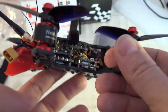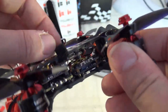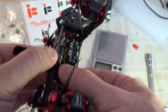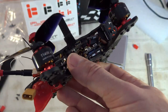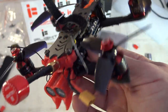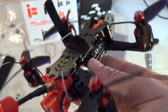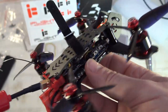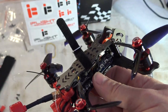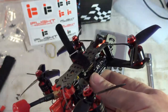So it's more like classic, and as I said previously, I already pre-flashed the new version of the Runcam Split Mini firmware. On the top right side, we can find the micro USB for the F4 connection. Betaflight is version 3.3 pre-installed, and bad news, at least for the video transmitter, nothing is pre-configured, so no IRC Tramp or UART1 is pre-selected. And in fact, with this version of Betaflight, when I did my first test, it's not working.